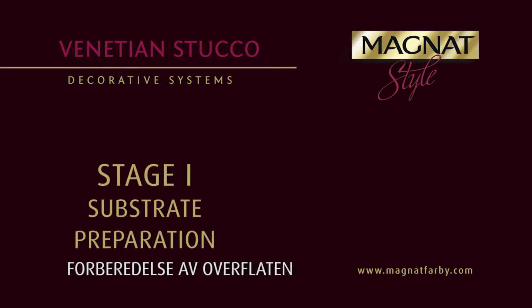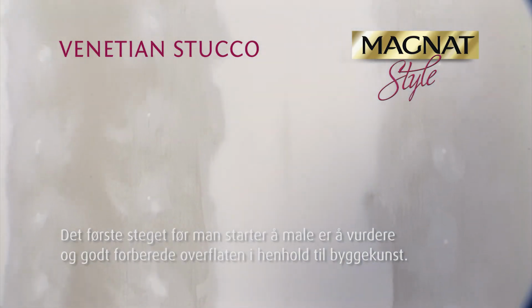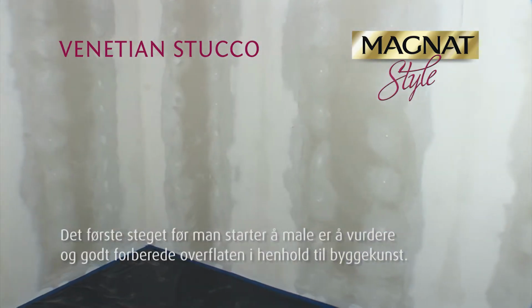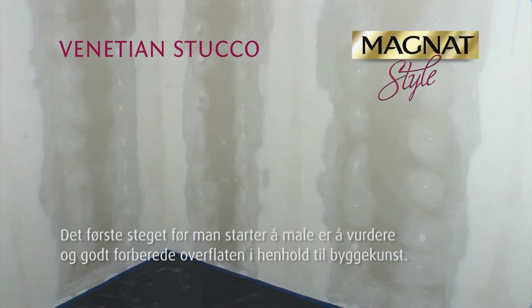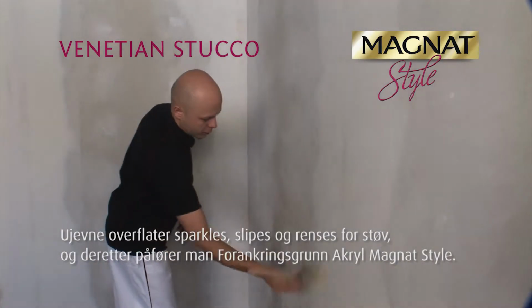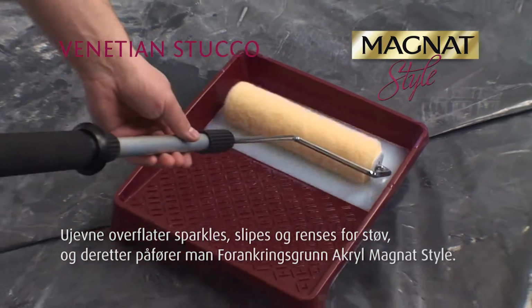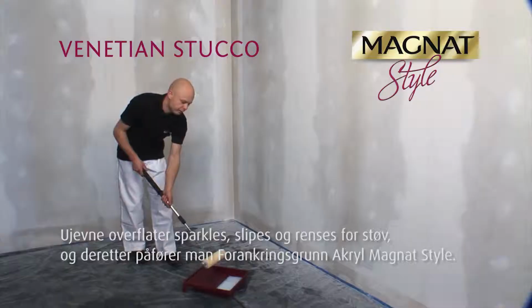Substrate preparation. Before starting work, examine the surface and prepare it in accordance with good workmanship practices. Fill, sand and remove dust from uneven surfaces. Next, apply Magnat style acrylic primer with a roller.